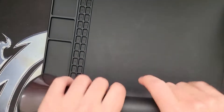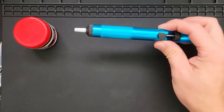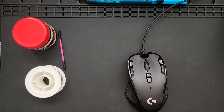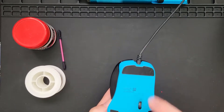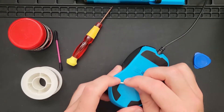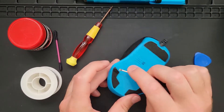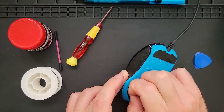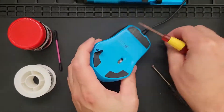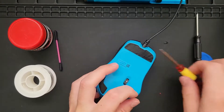The silicone mat prevents things from moving around and is also soldering heat resistant. It's got places to put your screws and other small components, there's a magnetic strip on the back so you can hang it on your refrigerator, you can even roll it up and store it in a bag or drawer — I'll link this one in the description. The materials you need to fix your mouse are: flux to help your solder job, a desolder pump, Q-tips, solder, and your broken mouse. The mouse has screws under the plastic covers which you can pry off with a flathead screwdriver. Make sure to unplug your mouse from the computer.